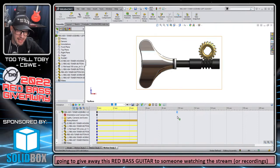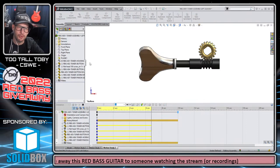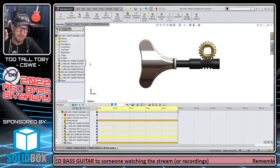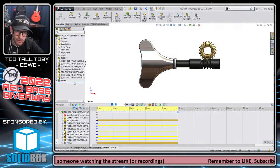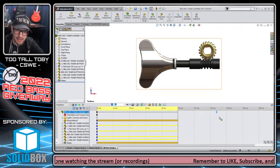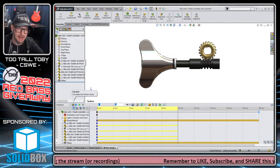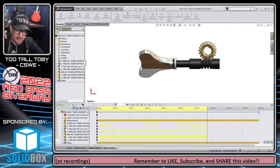I'm going to drag this out to say 10 seconds and say calculate. What I'm looking for here is a basic validation of whether or not I got my gear ratio correct, whether or not I got my pitch correct. Does this thing let me rotate all the way around? Maybe I'll take it out to 20 seconds and do the same test. Or maybe I'll increase the rotations per minute in that motor that I created.